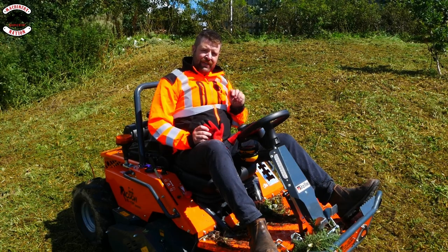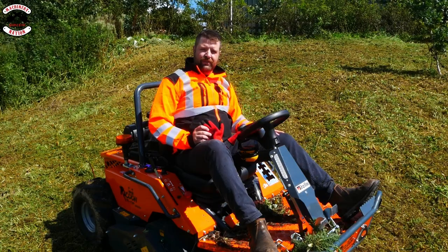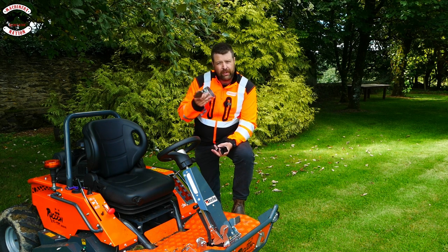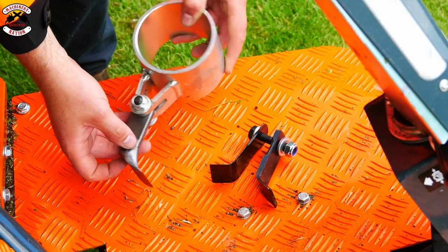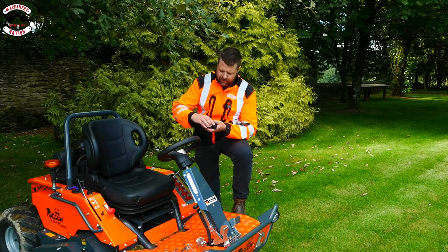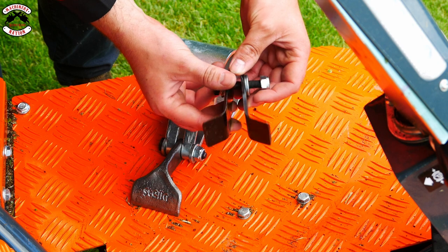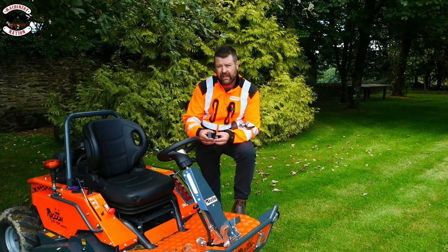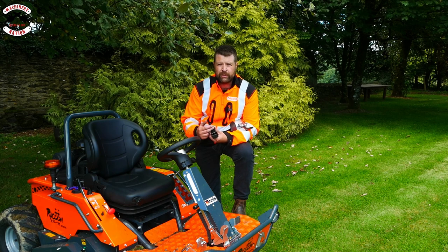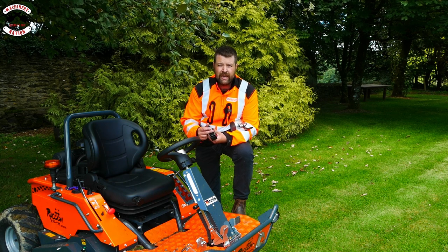On fine finishes — this machine is meant to give a really clean cut even on grass. Before cutting lawn grass, let me show you the two different blade types fitted to Stellar Raccoon ride-on mowers. On the municipal version we have here, we've got hammer-type flails, which give a really nice clean finish with an 80% mulch. On non-municipal versions you get Y flails, which give a 100% mulch finish and a slightly less clean cut, but they are swing-tip and act just like a normal flail blade. These blades are stamped with Stellar's name — they are heavy-duty forged blades, not cheap flails you can pick off the internet.